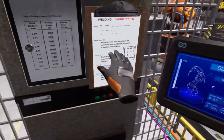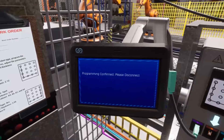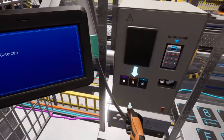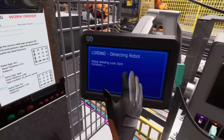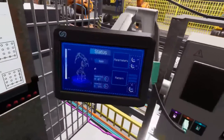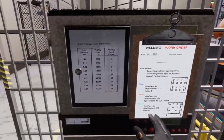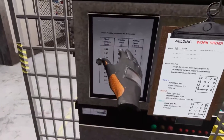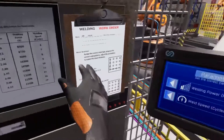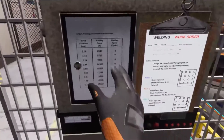Select the confirm button on the home page and we'll move on to the next pair. Next we'll set up the robot arms in the second row. Unplug the programmer's tablet from the first USB slot and plug it into the next one. The programmer's tablet has automatically detected the spot welding robots in this row. First let's set the parameters for these robots — use the highlighted work order and metal thickness chart to set the values.